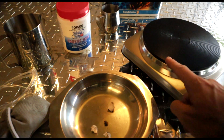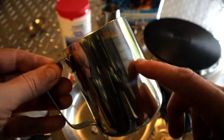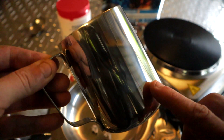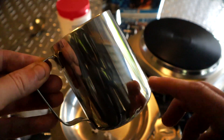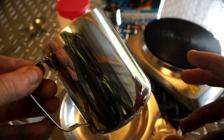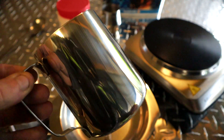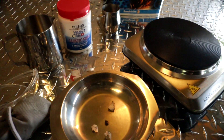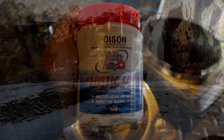The things you're going to need are an electric hot plate and a stainless steel creamer. You'll need a good stainless steel creamer because the sodium hydroxide will affect it if it's not good quality. The best way to check is put a magnet on it — if it's got good chromium and nickel and other elements, the magnet won't stick, whereas the more iron it's got, the magnet will stick more. You'll also need a stainless steel tablespoon and some water.